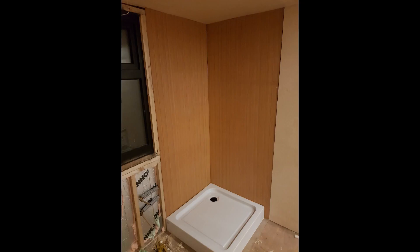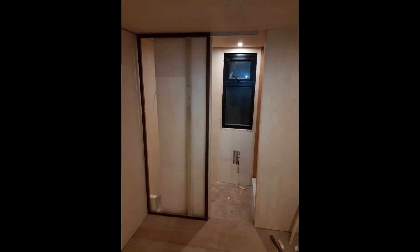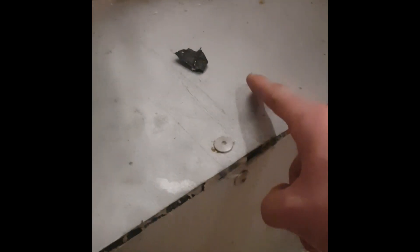Unfortunately, I don't have a lot of footage of the process of framing the internal walls. But trying to install a pocket door inside of a four-inch wall is a little bit more complicated than I first thought. There's a storm outside and I've got the pocket door kind of done. This is the bathroom — this is where the door goes. I'm going to put an edge banding around the door frame to hide everything. The heater's on, it's 25 degrees in here. These panels are literally directly attached to the outside of the building — a perfect example of a cold condensating surface.